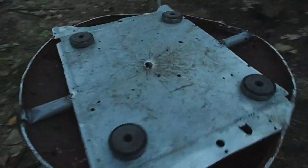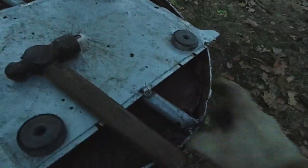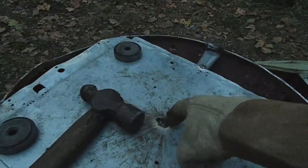Well, it's done — just gotta grind these down a bit. So I welded it here, here, here, here, here, here, and here, and the main rod I welded here, and here, and all across there. Then I welded the plate to it right here and right here. I turned the welder on maximum in order to burn through the metal and welded it right there. So that should be plenty strong.